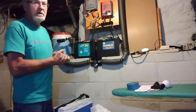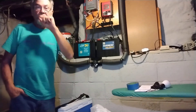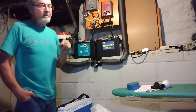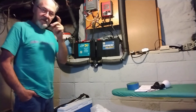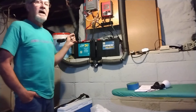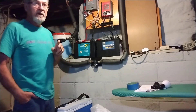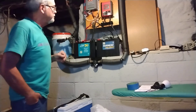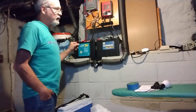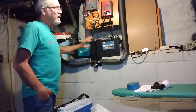When the temperature gets to 138 degrees the fan comes on, and when it drops 10 degrees to 128 degrees it shuts the fan off. That fan cycles about every five minutes and it keeps the basement pretty warm, which it wasn't last year.